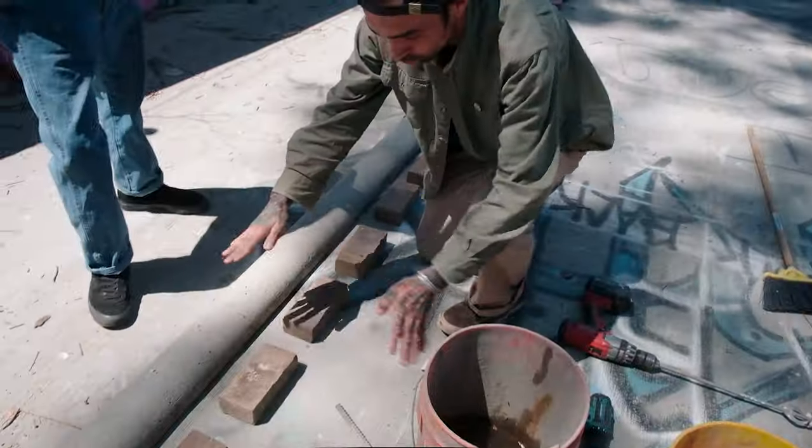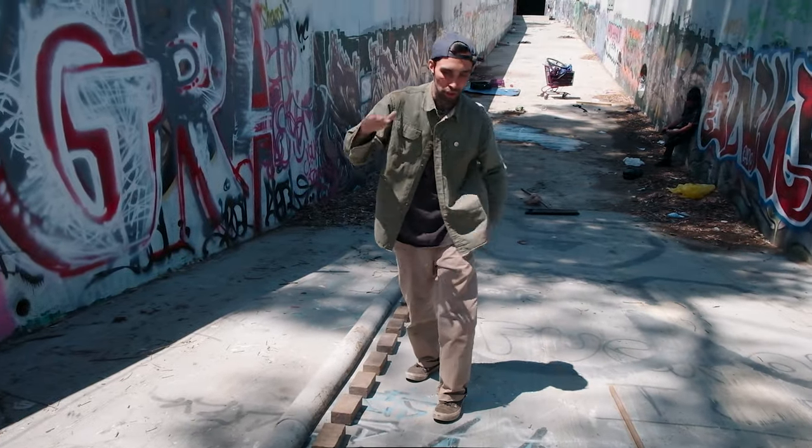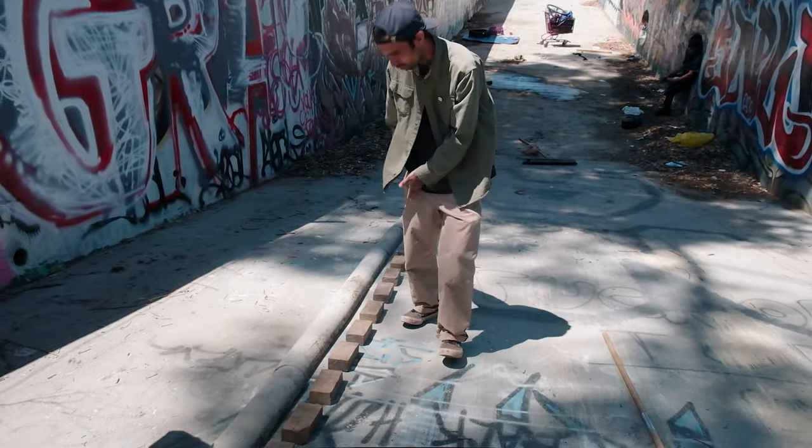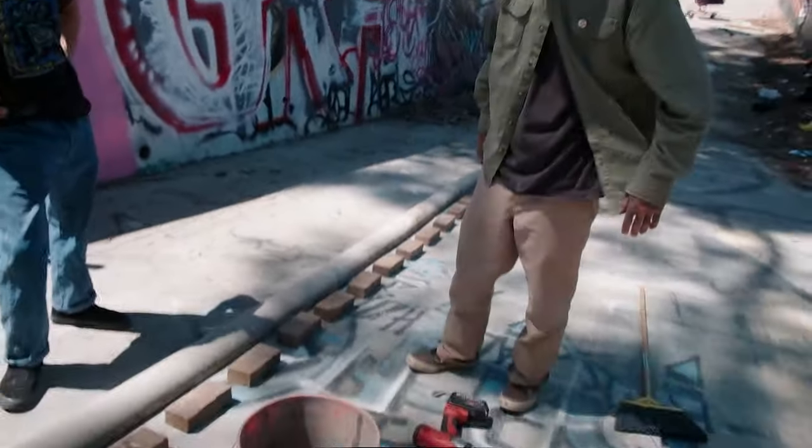We're going to fill it and trowel it the whole way. We're not going to fill it and then trowel it. Just going to do it all at once, all the way down. It makes sense as you lay it down, because it's Type S. That's the one thing for sure. The stuff is so fine, it doesn't have any rocks in it. So basically you could build a transition as soon as you're throwing it down, because it's got that nice fine texture.